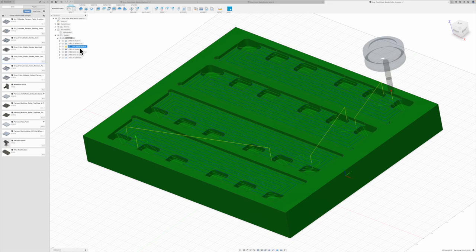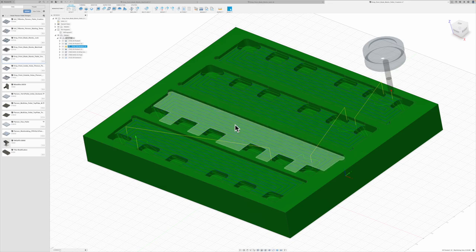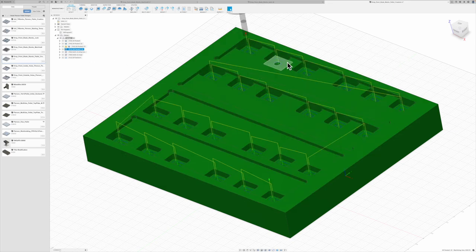But then when I get to the 1/4 inch, the other thing I did to get rid of the spiral downs is I set it so that I do these 4 pockets as one machining operation, and then we do all the deeper pockets as a separate machining operation. Same thing, it's just gonna plunge straight down. It's gonna go through that last 25 thou worth of material and should cut considerably quicker on these.